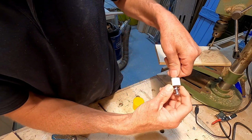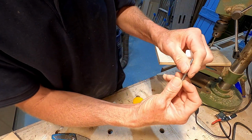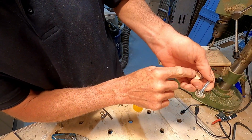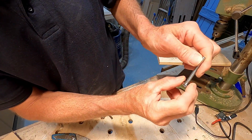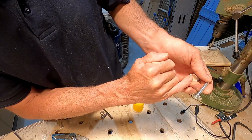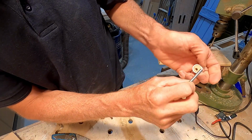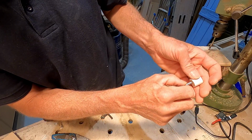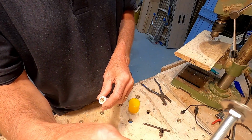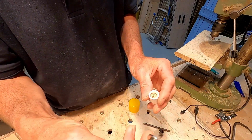So to hold the head of the key on there, you need to put a nut on there, and then just countersink a hole so that it holds it tight in position, but the thing's still allowed. You've oversized that hole out enough so that the whole thing can still turn as one unit. So I've stuck a nut on the back of there, so the top of the key is now jammed onto the nut, nice and tight.